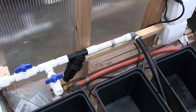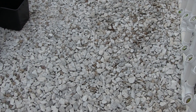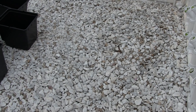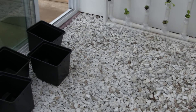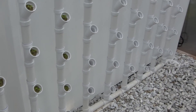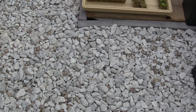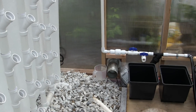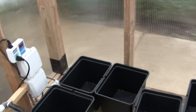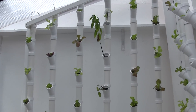We are in Chicago, so obviously we'll see what happens in the winter. I did put in — and you can see here — this orange line is a pex-al-pex tubing, and I ran about 200 feet of coiled tubes underneath this foundation, which is rock, and underneath that I have sand. The base of the greenhouse on each of the four corners goes down with a 2-inch Owens Corning insulation board between 2 and 3 feet, and the floor of the greenhouse is insulated with a 2-inch insulation board that sits about 8 inches below grade, then a layer of sand, then the pex-al-pex, then another layer of sand, and then the rocks.